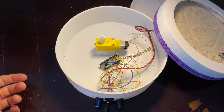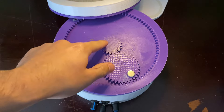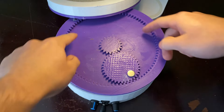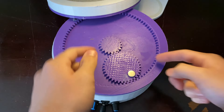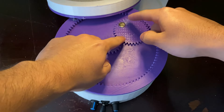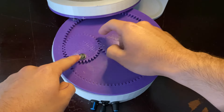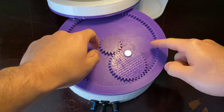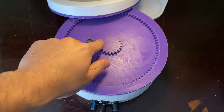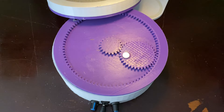This is how the machine actually draws. We have the neodymium magnet here on the driven gear, and this other gear on the outside with teeth all around it helps keep the driven gear on track. As it spins, the driven gear also spins, creating a straight line; then when it comes back the other way it creates another straight line, and when it goes to the other side it's offset just a little bit, so the next line comes at an angle. It's all about the ratio of these gears — a different tooth ratio would create a totally different design — but this star shape is what I liked, so I kept it.